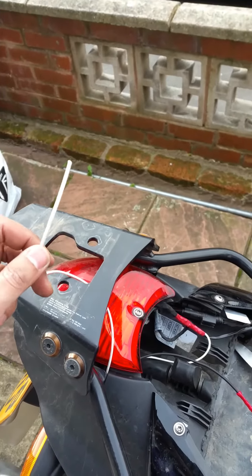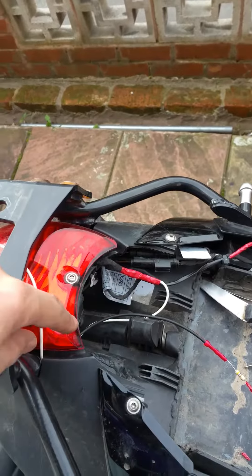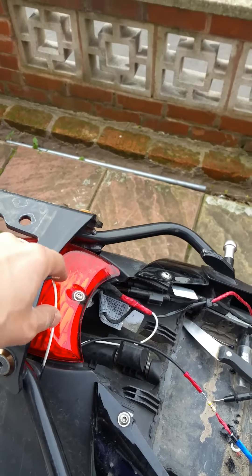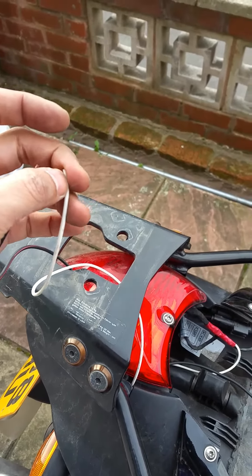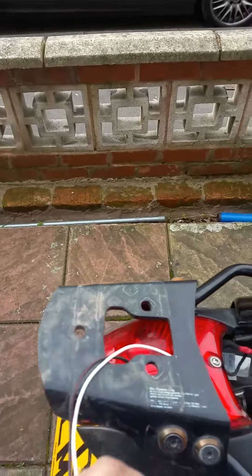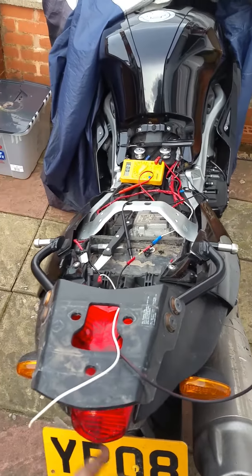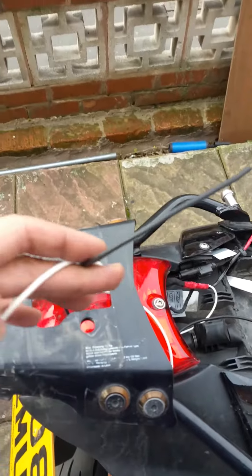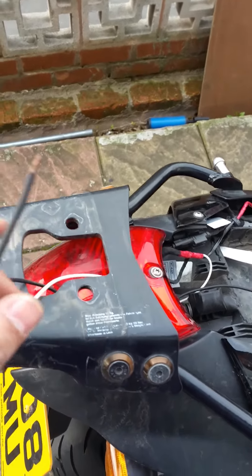This cable will also be connected into the positive — both of those will be connected into the positive. But that's connected to the unrestricted 12 volts that feeds the rear brake light. So when I put the brakes on, this will send the current that will override that and the lights will come on brighter, giving that indication that the bike is braking. Having it on the top box gives more visibility so people behind can see that you're braking, and also see you in the dark when your lights are on.